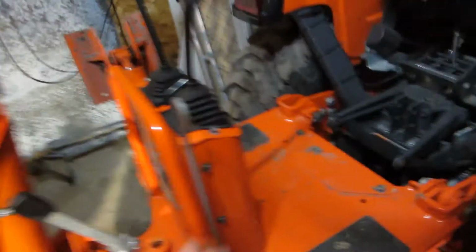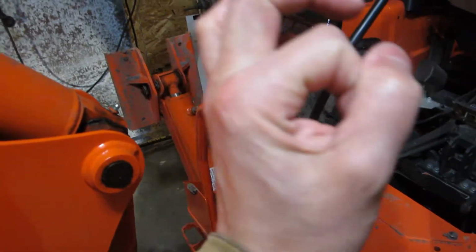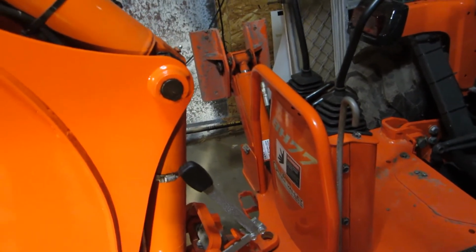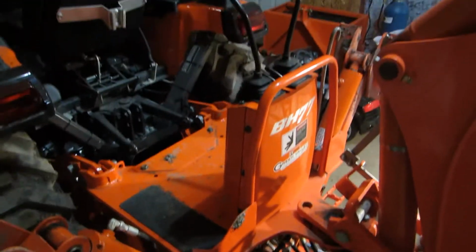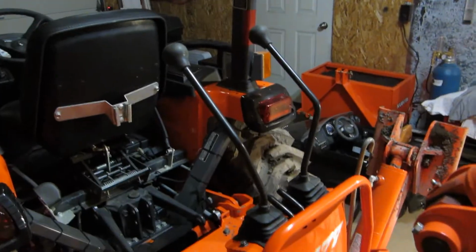And what I noticed today is I took this apart here. I should have put it on video, but I took it all apart, and it's like little tie rod ends with a pin that goes through it, and they weren't lined up very straight. I mean, they were really crooked. Now, to me, that's somebody who put that together in a real hurry at the plant. I don't understand that at all, but I opened her up and I put them all straight, and when I straightened them out, of course, I put some nice grease in there.